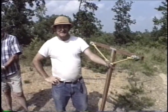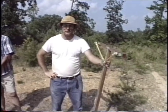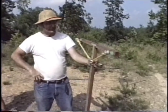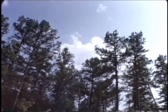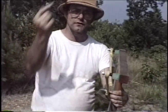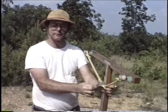This is an antenna launching device. It's a take off on a 14th century English crossbow that was used for throwing stones at small game. What we're going to attempt to do is to throw instead of a stone a six ounce fish weight right over the top of one of these pine trees, and it will carry a fish line to which we'll attach a smaller line and then a larger line so that we can use this to haul the antenna up finally.